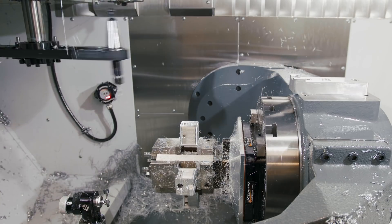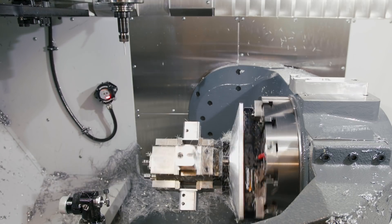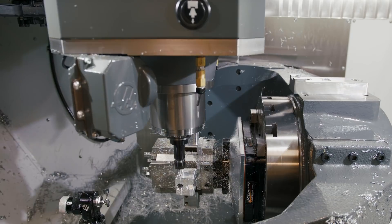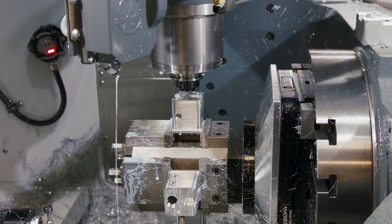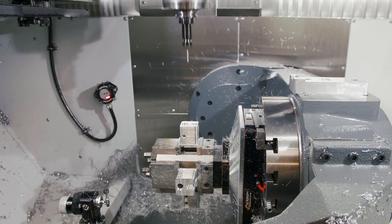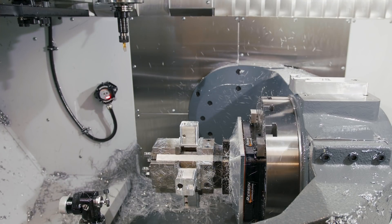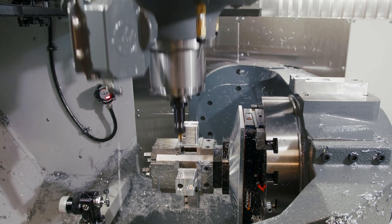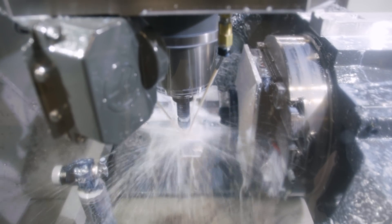Next tool is a simple small drill breaking through into the main valve section, and doing the exact same thing on the single hole on the back side of the part. Following that is a one-eighth 27 NPT pipe tap. The TiN coating on this works beautifully in aluminum.